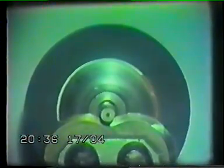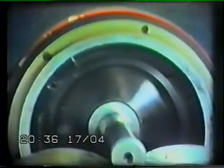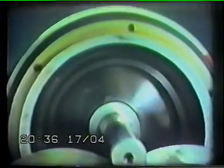An unbalanced wheel will revolve. This needs correction by truing. Frequent truing will keep your wheel concentric on its spindle and thus eliminate the danger of damage to the wheel from excessive vibration. Any inherent variation in the wheel's characteristics can be counteracted by adjustment to the balance weights, which we can see if we look more closely at the wheel.